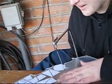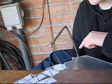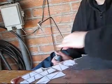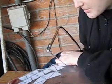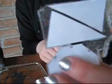The most frustrating thing about working with a coping saw is the back here gets caught on the edge of your piece, so it has to be figured out on a case-by-case basis how you're going to get around that, depending on the shape of the piece. That actually cracked. Didn't crack under my piece, so I'm safe. You can actually get a little bit more distance by tilting your saw at an angle. There's the corner here.